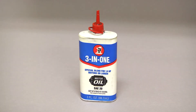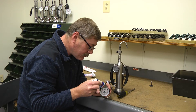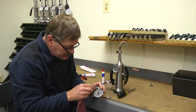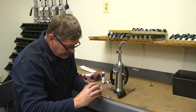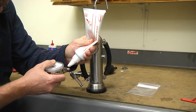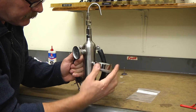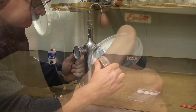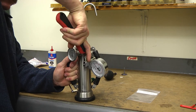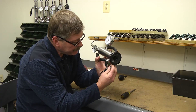Using light machine oil or silicone spray, place a few drops in the gap around the bottom of the gauge case. This will help lubricate the springs and linkages, promoting proper movement. Apply some Teflon tape or pipe dope to the threads of the gauge. Reinstall the gauge, tightening till the gauge face is located in the forward position facing the operator. Reinstall the clamping device screw.